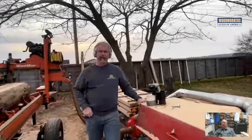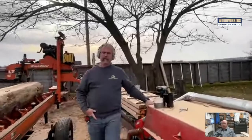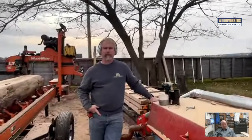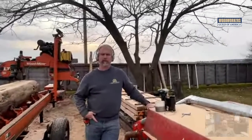Yeah. And I've been very pleasantly surprised. I've got my little chainsaw mill, and there's a lot of stuff I've run into where it's cool, but I can't get to it right away. And if it's someplace where it's not in direct sunlight and it can stay wet, the ends might go south because it starts to crack from the ends. But it's amazing how long the interior of a log will stay wet enough to not give you a real bad crack problem. But then it is, like Dwayne said, that fine line. Somewhere in there, the wood maybe starts to spalt, which is cool when it gets black lines. And then somewhere spalting turns to rot, and then it's not so cool. So, it's a mixed bag.